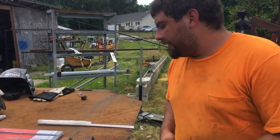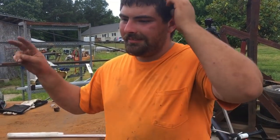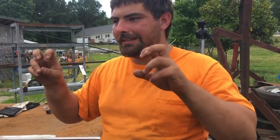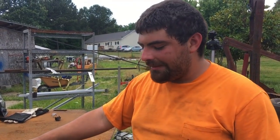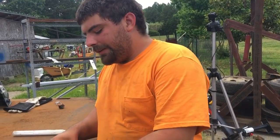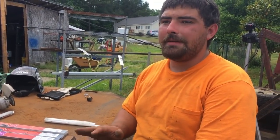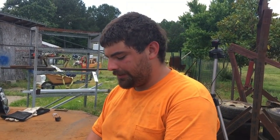But, so for when you're stick welding, and these really ain't even stick welding, they're more of a braze, really, because none of it's stick weld, none of it's really welding. These are really kind of a braze. It's really interesting to see. But when you're doing the stick method, because there's so much heat input to it, you have to get this preheated up to 350 degrees is what I use every time. It works every time. 350 degrees, it works every single time.